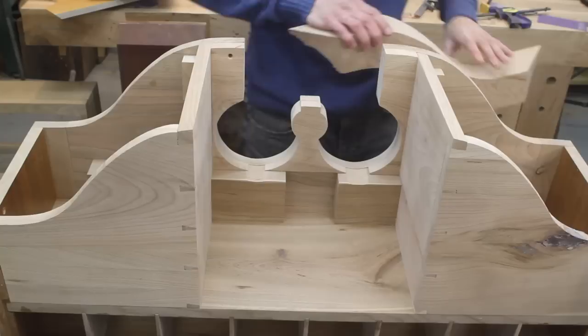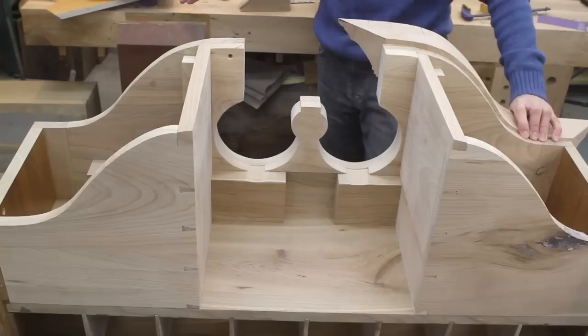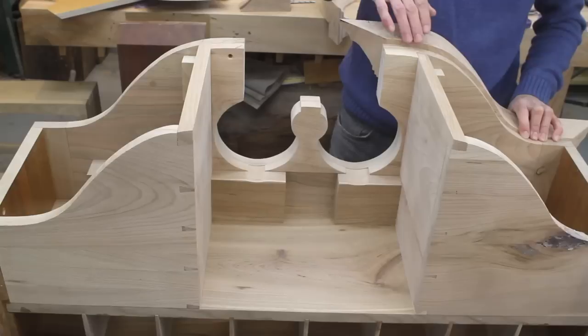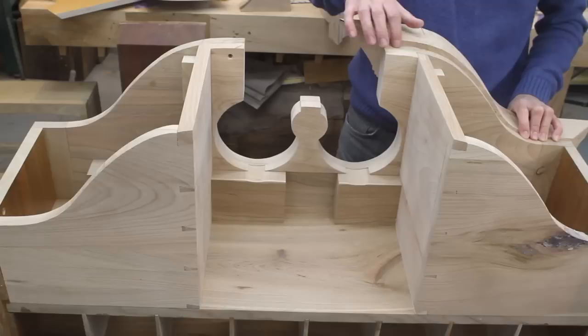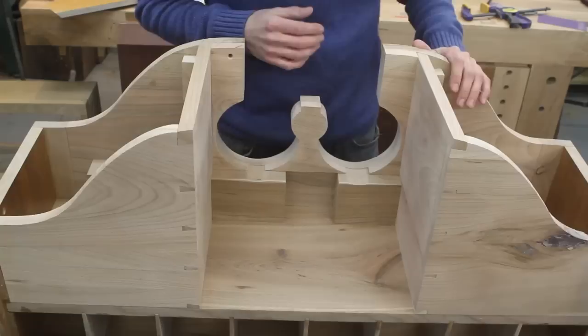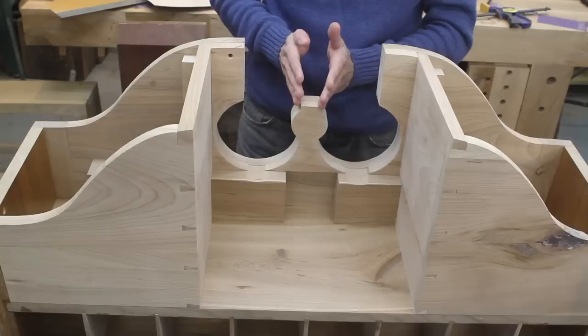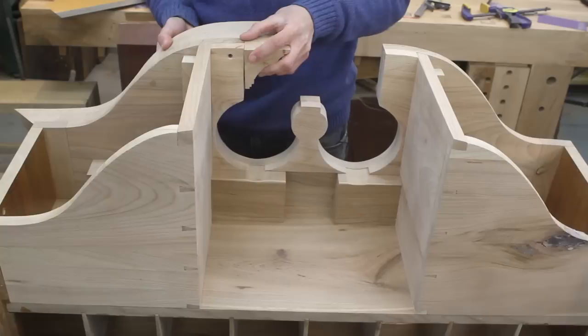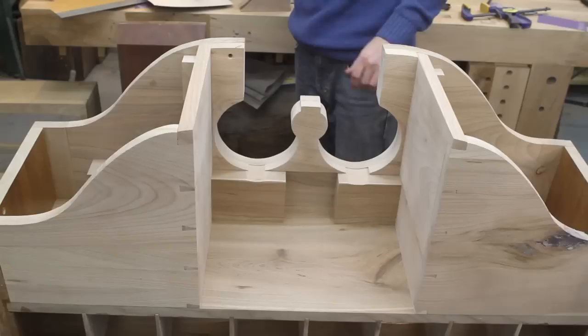When I go to attach the moldings, they're going to be attached a little bit higher than the scroll board. They'll do two things for me: when I attach the bonnet top, the moldings will hide the edge of that bonnet top and also give me a little bit of leeway so that when the scroll board expands in the summertime, you won't end up seeing the top protruding past the molding. There are a few other things going on here as well — I added some blocking to the back just to thicken things up. On this center piece, this is where a finial is going to go — an urn that comes up through the center of the case. The thicker parts over here were for the returns on the molding, just to thicken things up.